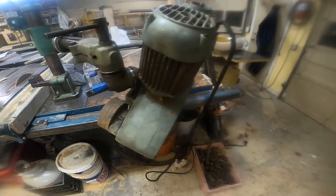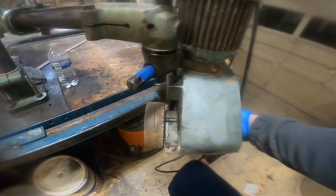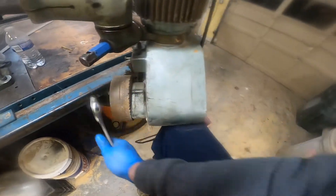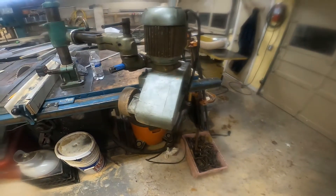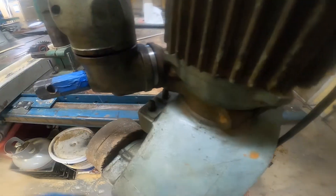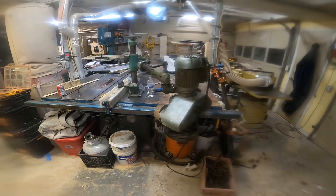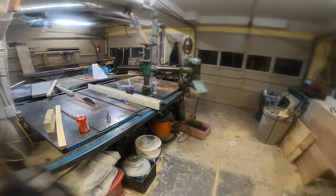I think we have a success. See how it's rocking? I used to not be able to tighten this thing and keep it parallel. I'm going to tighten this up — look at that, it's holding up flat, nice and straight. My little steel bushing in there is doing the job. Awesome, love it. That is why I got a metal lathe in the beginning — to fix my old woodworking tools.